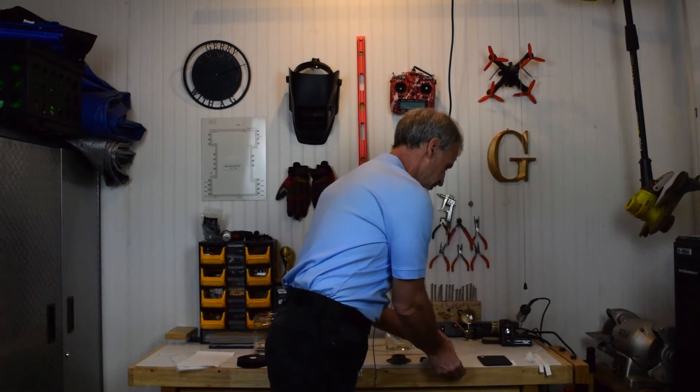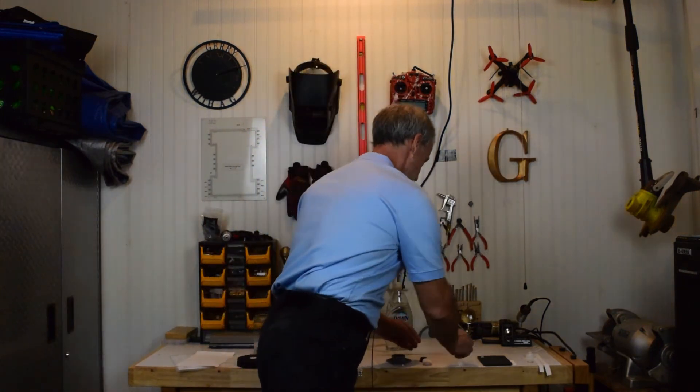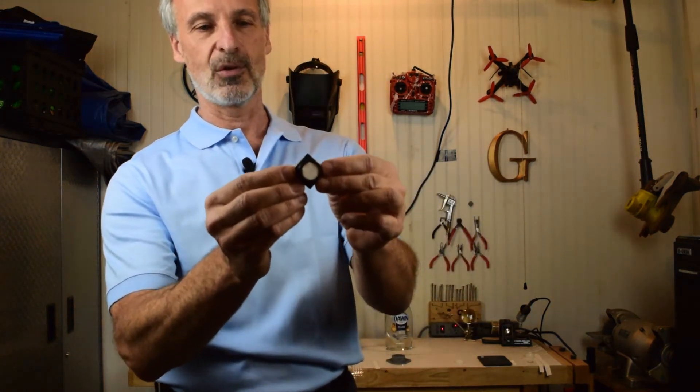The next technique is a snap-fit or clamping. This is where the Porex PTFE is trapped between two parts or two halves of an enclosure. You take a Porex Vertec PTFE disc, put it into the enclosure or whatever the final device is, and there's a snap ring or some other secondary feature that snaps it into place — and once snapped in, it works perfectly as a vent. In another example, you take a Porex Vertec PTFE disc into one half of the product, insert the second half, and it closes and snaps into place, giving you a working vent in your enclosure.